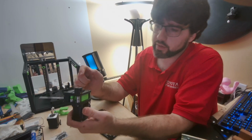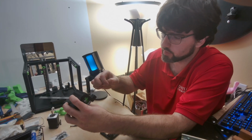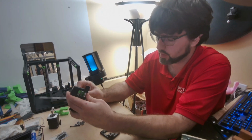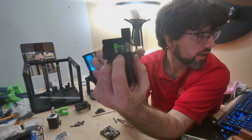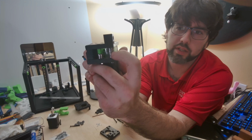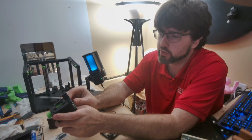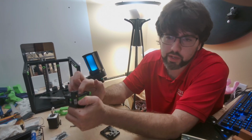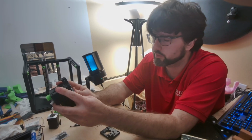Once you get that in there and one screw kind of snug down, again, you don't have to be super tight or anything like that yet, because we may pull it back out. This is a good time to look in through here and look at where your belt drive pulley is, and then your bottom pulley stack here. And what you're going to do by that is make sure that those are lined up correctly and centered. And then we can go ahead and lock these grub screws in, making sure we don't need to do any up-down adjustments.